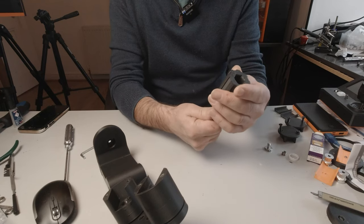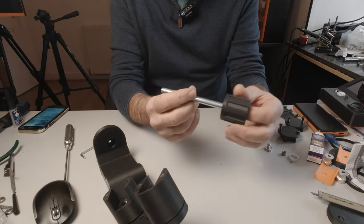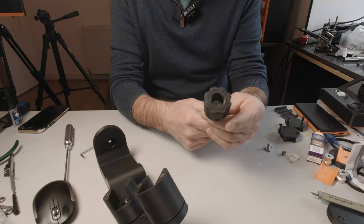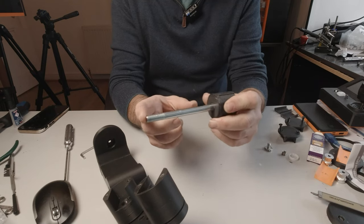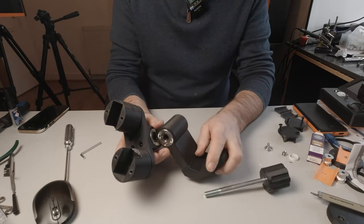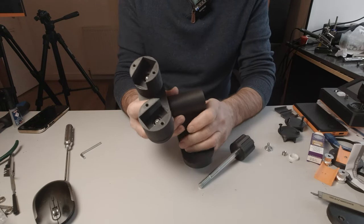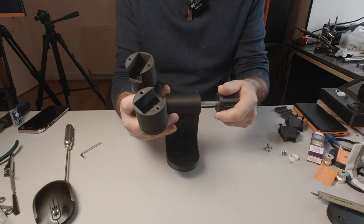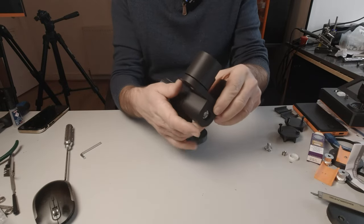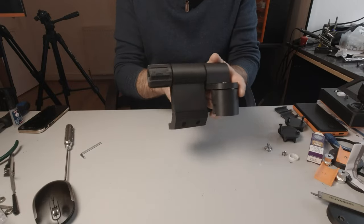Take part 39-90, which is the tightening knob, and run an M8 hex head bolt — 120mm long — all the way through that, running it all the way down to the bottom. Take those two assemblies, attach the roses, run this all the way through the two parts and into the M8 nut on the other end. That allows you to tighten or slacken the plate with the camera on it.